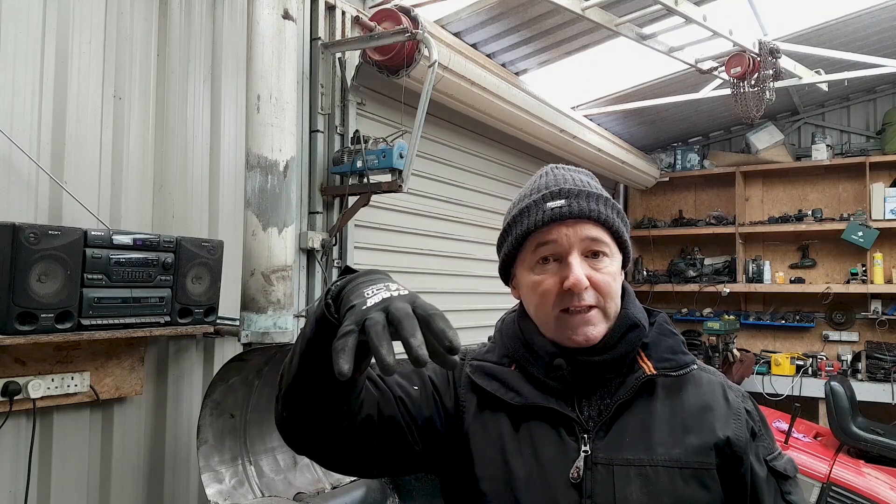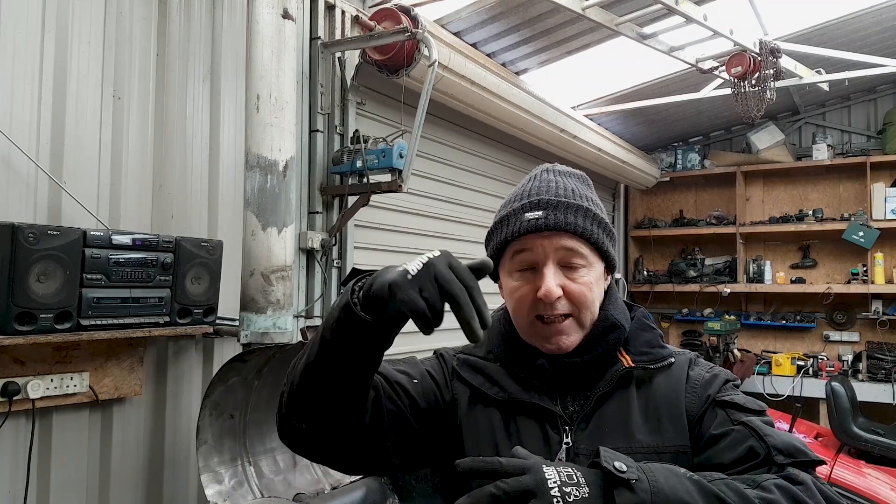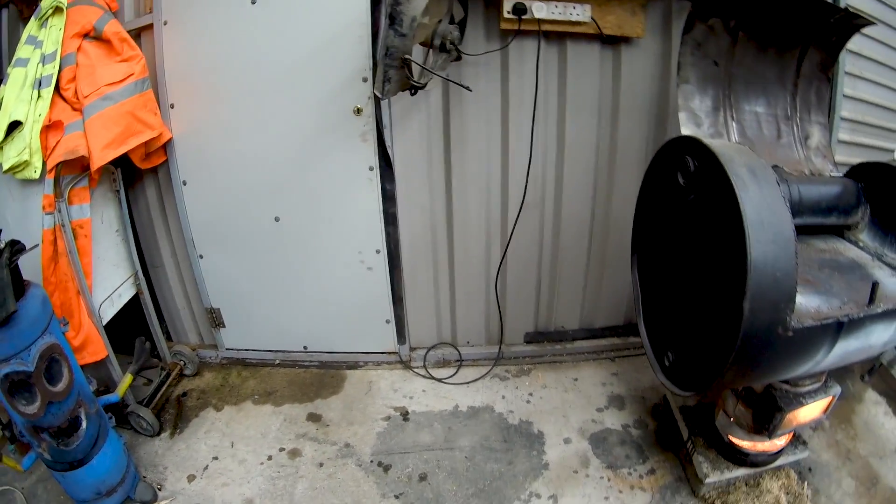The separator plate forces a big volume of air through - you get mixing and it expands out on the other side. But mixing works even better if there's something in the way, like a car brake disc, which gets red hot. Any unburned gases hit that red hot surface, get agitated more, and burn better. At the moment, minus a burner with just a few bits and pieces thrown in, I have a very clean burn, just dripping waste oil into it. I had intended to burn wet sawdust but I don't have the space in that unit - I'd need a bigger unit, something like a barrel. It's cold out here today - I can see my breath even though the temperature is rising nicely.